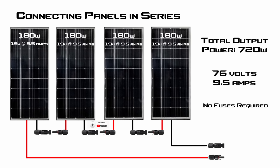When connecting solar panels together in series, you actually don't need any fuses. The short circuit current for these panels is 10.23 amps, and because the amperage stays the same, if you short-circuited this entire array, you'd only see 10.23 amps. Now if you use 12-gauge wire, that's rated for a full 20 amps. So if you short-circuited it, you wouldn't have any issues. That's why this setup does not require any fuses — of course you can install them if you want, but you don't have to, as long as you use the proper wire gauge.